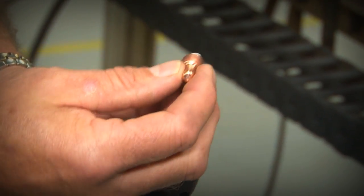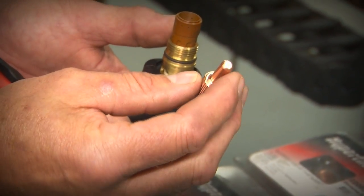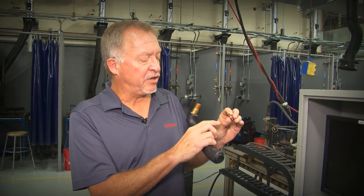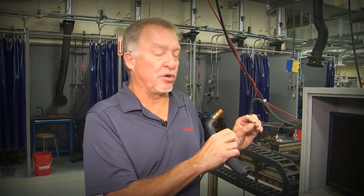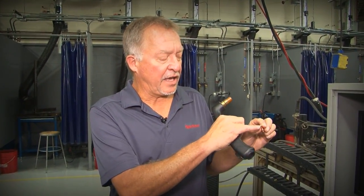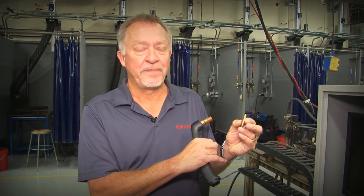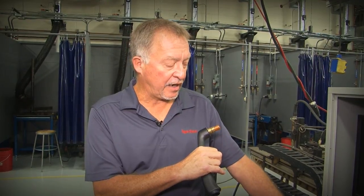The next part is the electrode. On this particular torch, this is called a spring electrode — it actually has a spring-loaded plunger on the rear end. It also has what we call a spiral groove, which is used as a heat exchanger to get some of the heat out of the front end of the torch. Whenever you look at the end of a plasma cutting electrode, you'll see a copper body and a silver-looking material on the inside. If the torch is designed for cutting with air or oxygen, that insert material is going to be hafnium, which is an earth element. On the end of this electrode where the arc attaches, temperatures can reach 3,000 degrees Fahrenheit during steady-state cutting. The electrode will typically last one-to-one, almost the same life as the nozzle, depending on what and how you're cutting.